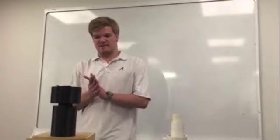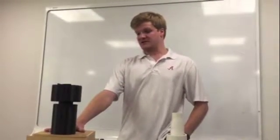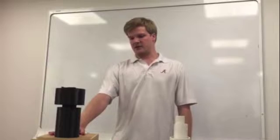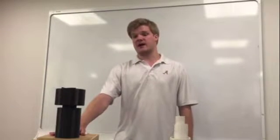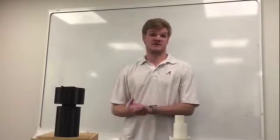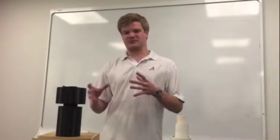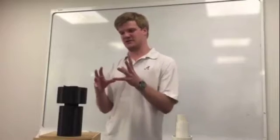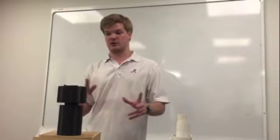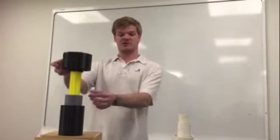Our device needs upgrades — it's a very primitive design. As far as sleekness goes, we are pretty happy with how it looks. Another constraint was that our 3D printer could only print 5.75 inches, pretty much a max of 6, and we wanted to stay well within that range. Instead of gluing several pieces together, we wanted to stick with one solid piece. In the future we could have taller shafts, and even though that would decrease stability, we could have several more shafts instead of just two.